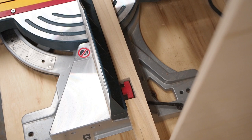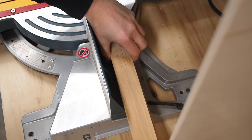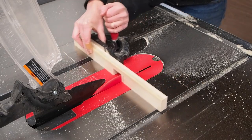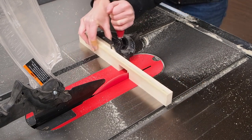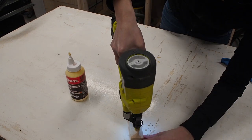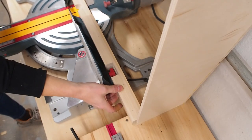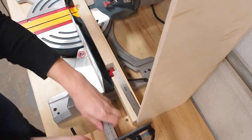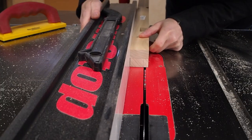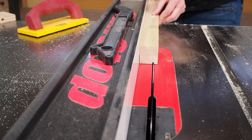All good. The next minor issue is that the knobs reach right up to the top of the rail, and I want to make a groove where the doors will slide, so this is a problem. An easy fix is to add another piece of wood to build it up. I transferred the cutout onto my second piece and used my table saw and miter gauge to cut out the groove, then glued the pieces together with a few brad nails to hold it in place while the glue dries. Make sure to put the nails in the back half since you'll be cutting a groove in the front half. I set my table saw blade just peeking out of the table and made a shallow groove in two passes, just wide enough to loosely fit some one-eighth-inch plywood I'll be using for the doors.